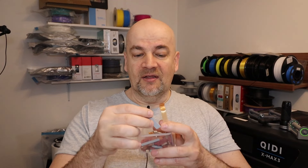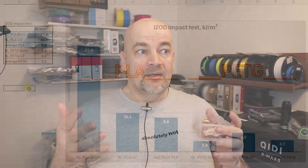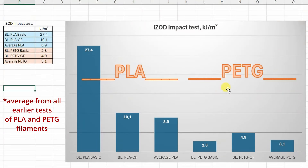For comparison, with the PLA-CF from BambuLab we have great layer adhesion. About the basic and translucent — I actually like the translucent better: it performs better in most tests and I also like the transparency of this material. About the impact test, this is something I want to investigate more because in a previous video comparing three BambuLab PLA filaments they performed better — the breaking energy was higher compared to these PETG filaments. PETG is a more flexible material but the break load is smaller compared to PLA, so PLA will not bend but it will break more suddenly — that is why users usually think PETG is tougher. This is something I want to investigate deeper, and I hope you will follow me to that video. Until then, thank you for watching and happy printing!